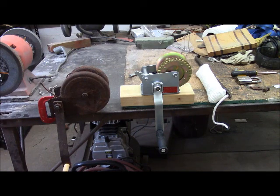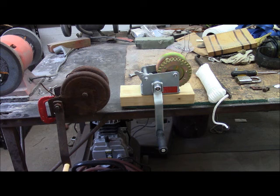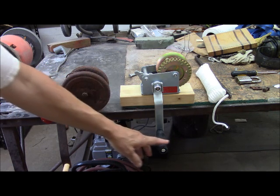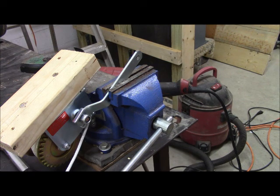I'm going to attach a winch to the crib. So I'm going to go ahead and install this new one here. And we're going to thread it up with this nylon rope and attach it. I'm going to have to put it on another block so that when I rotate the handles, I'll actually have room to clear. Even after rounding the sharp corners of the handle, that handle is still too long to clear the wall, even after I mounted it on the 2x4. So consequently, I'm going to take the angle grinder and shorten it about 1 inch and sight and drill another hole and reattach the handle.